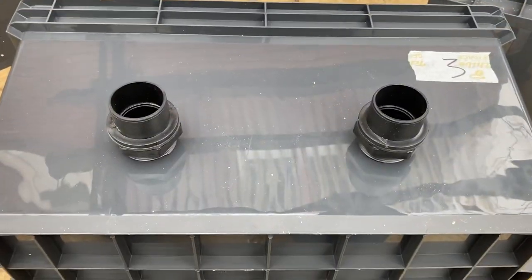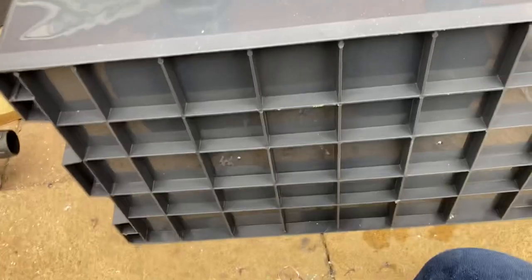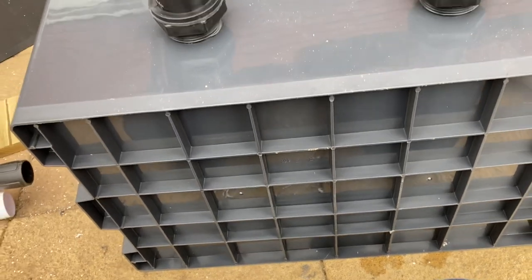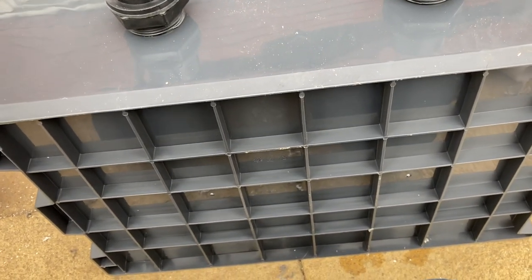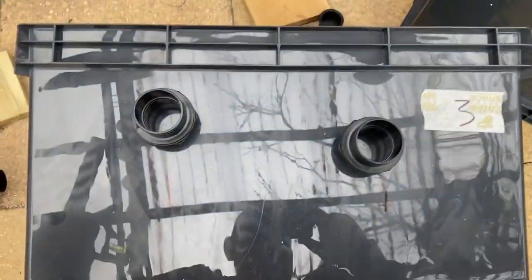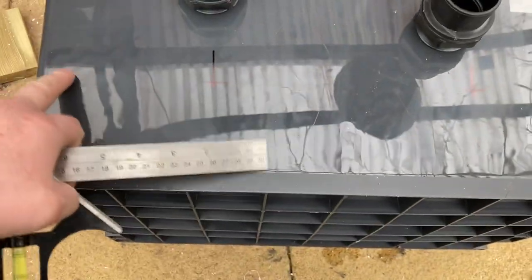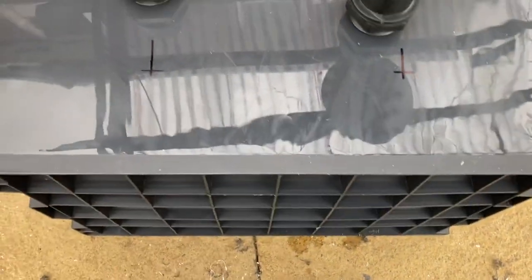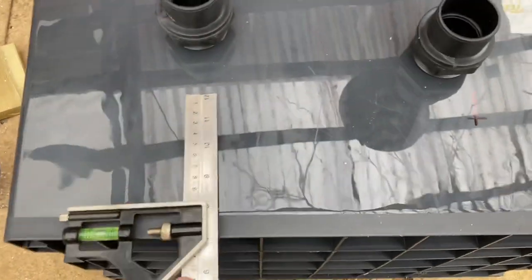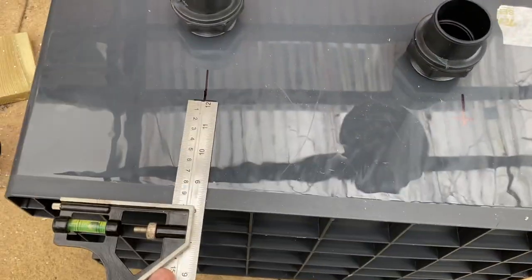Okay, I'm on box three now. This is just inch and a half holes again — just two holes. Whatever you do, don't drill the bottom — you don't need holes in the bottom of this one. I've used a square. I've got 150mm in from the sides, and then 100mm up from the bottom. So I'm going to go ahead now and drill those.